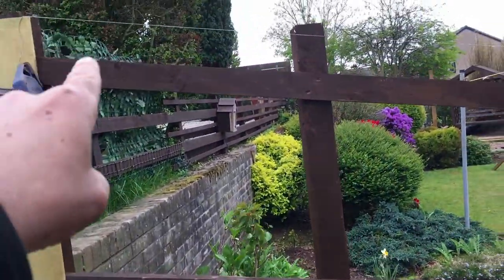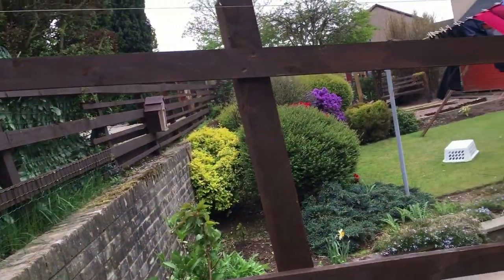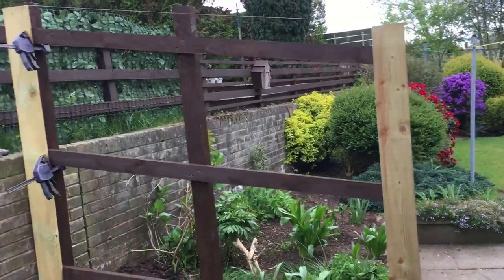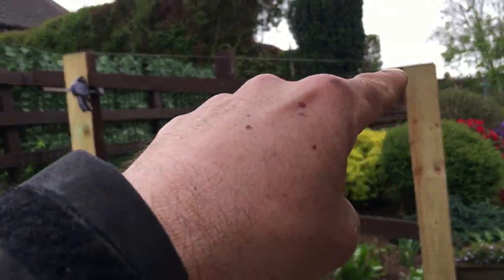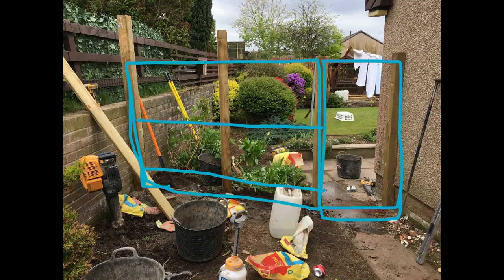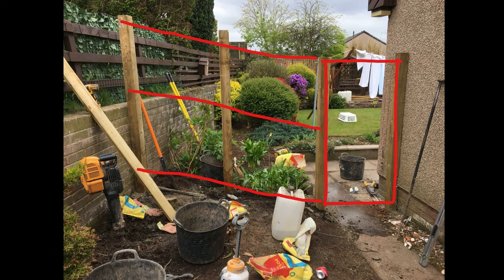There are the rails. I'm just setting out - I've just strung the line to follow that line, and that'll give us a nice straight edge at the top. This fence is not getting capped, so it'll just be the boards. I did actually give the client the option of taking the fence across keeping it square at the top, but the only problem with that is it would be low at the wall side. Or I gave him this option as well where we just angle up with the ground, and this is the option that he decided to go for.